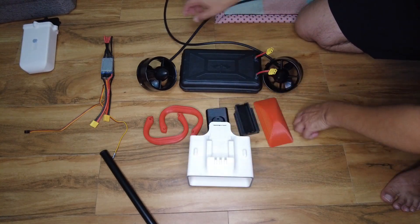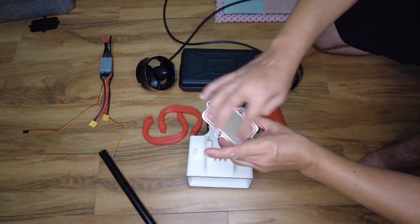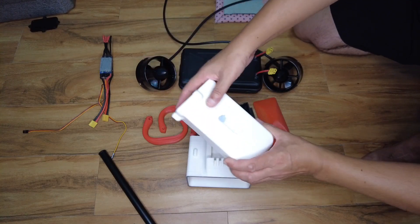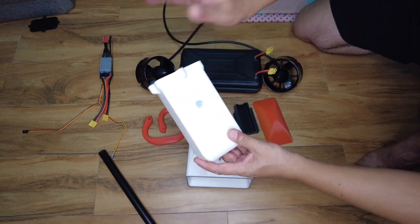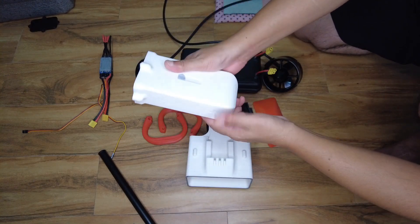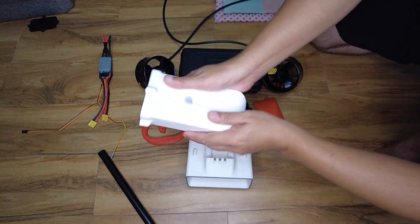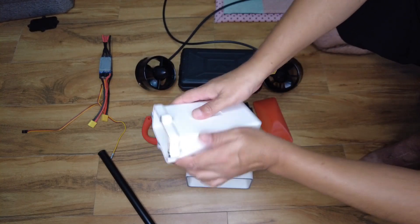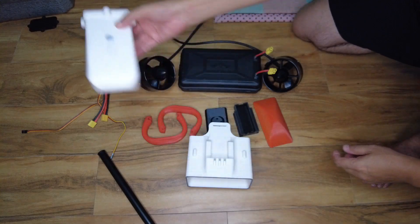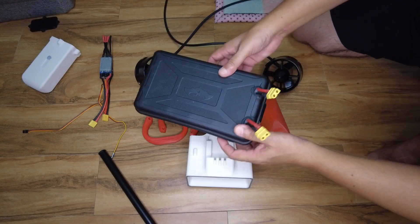My major issue was to waterproof the battery, 3D-print my own design, and try to seal it with different types of sealant. But I was only partially successful — water still went in, because normally PLA 3D prints are not that waterproof unless you sand them and put some kind of putty on them, sealing every line. Since FDM prints line by line, this approach didn't work out.